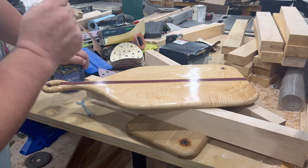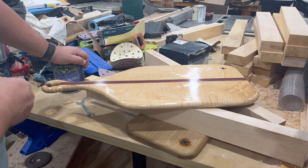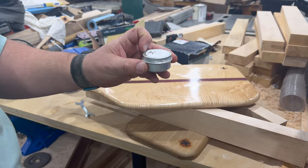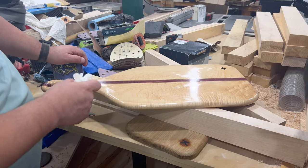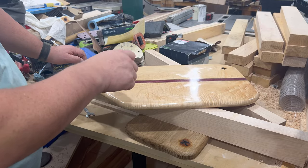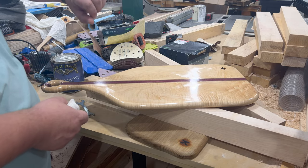When I do cutting boards that are actually meant to see knife action, whenever I sell a board, I include a can of that with it. The charcuterie boards I do as well, it's just in a smaller tin because the boards don't need as much. Anyway, I rubbed a thin coat on both sides. When I'm putting it on, it's usually just kind of a circular motion, a wax on, wax off kind of thing. I've let it sit for about an hour, 2 hours maybe.